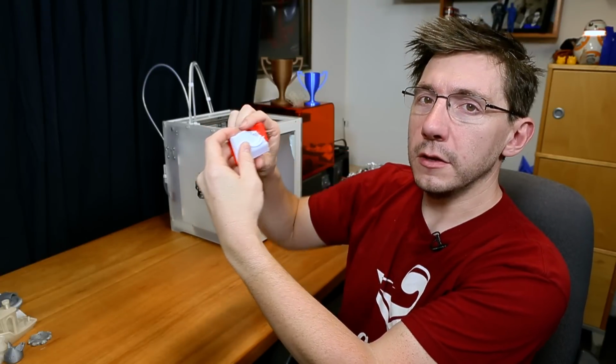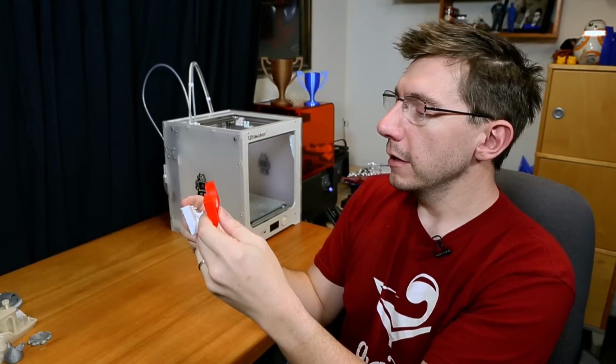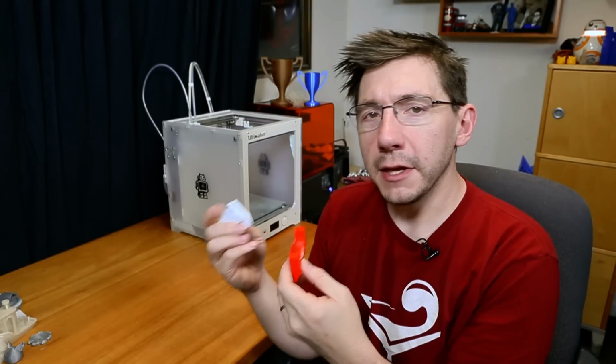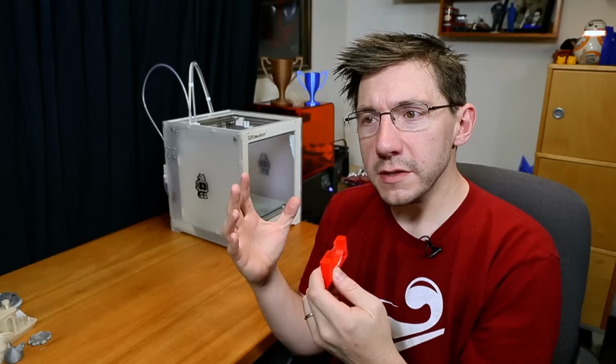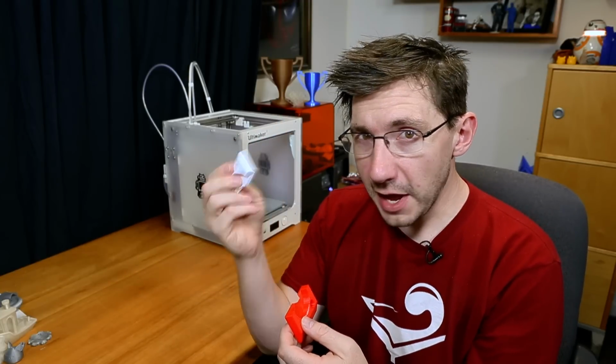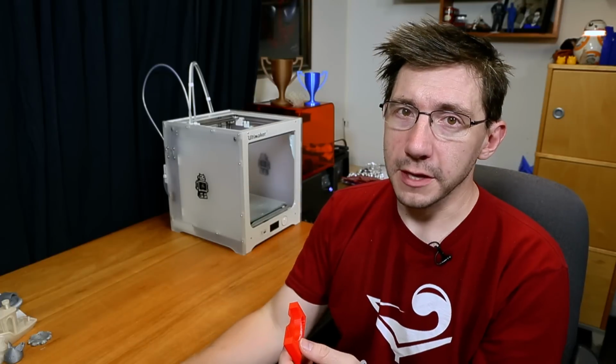So I replicated this piece using Fusion 360, and I was able to come up with the piece that was missing using CAD, but I was just replicating a piece that was easy to fail. So I knew that using 3D printing, it wasn't just going to be a practical use of replicating a piece. I had to make it better. And that's where flexible filaments come into play.